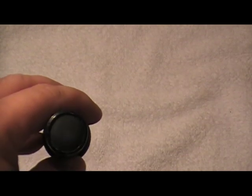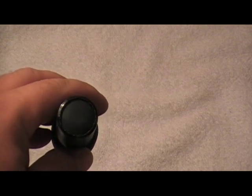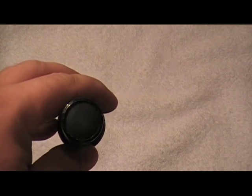Okay, the next step is when you take the cutter off, you'll notice that on the inside of your magazine tube extension where you made your cut, you're going to have a rolled edge. That rolled edge right there is smaller in diameter than the ID of the tube. The ID of the tube is 0.920 inches. That's the inside diameter of the tube. The inside of that rolled edge is going to vary because tubing cutters are not super accurate. But mine was about 0.840. So I had about 80 thousandths difference between the ID of the tube and the ID of the rolled edge.